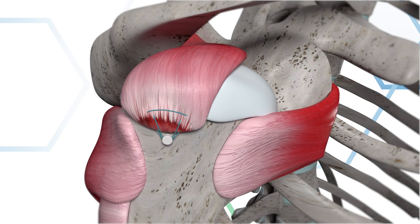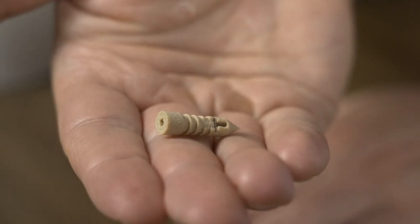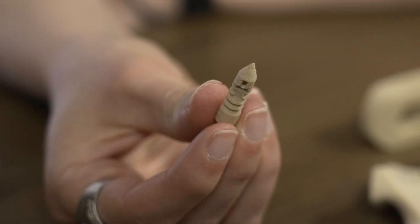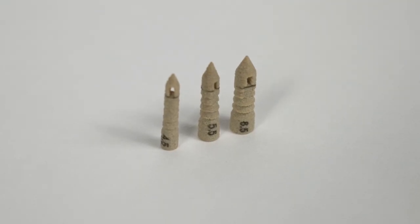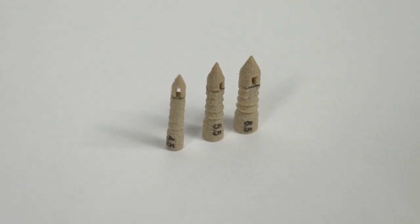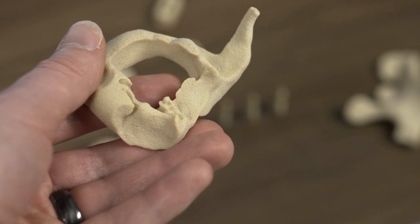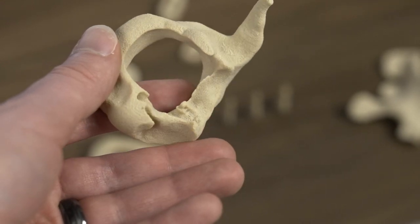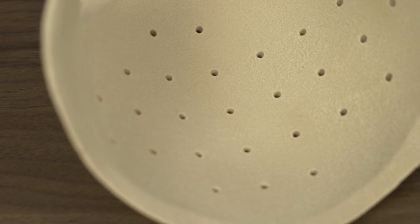They are made of PEKK, and the benefits of that material are realized in parts thanks to cost-effective production using 3D printing. Polyether ketone ketone, or PEKK, is a thermoplastic that offers mechanical properties similar to human bone. It also provides for good osseointegration, so your bone wants to grow into it, leading to better healing outcomes. And as OPM discovered, PEKK has this antibacterial property as well, so it is a safer implant in that regard too.